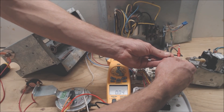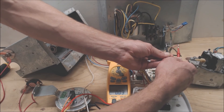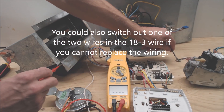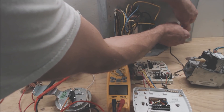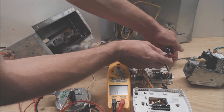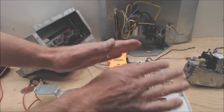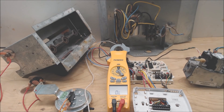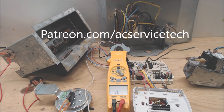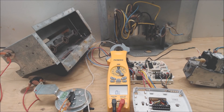Use alligator clips if you're not getting good contact on the wires. Right there you can see the problem is in the actual wires themselves. Now that you've found the fault, go ahead and replace that wire. You can also isolate the issue further by undoing wire nuts. Basically, that wire right there is the problem. To find a short in thermostat wire, you take sections of wire out of play, disconnect them from the control board, and test resistance values to find the problem. If you want to support these HVACR training videos, check out patreon.com/acservicetech. Hope you enjoyed it — we'll see you next time at AC Service Tech channel.